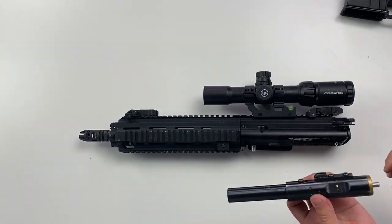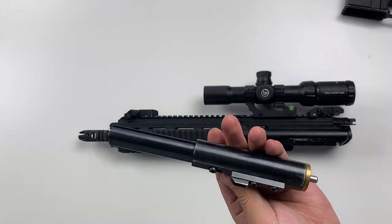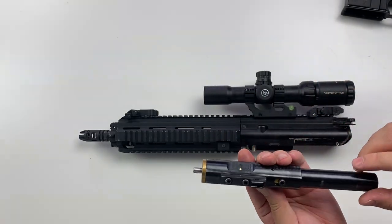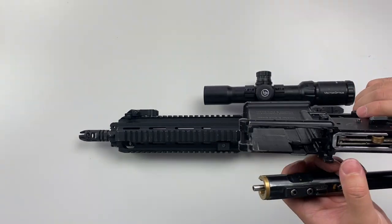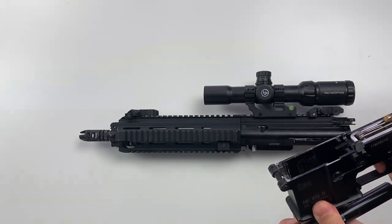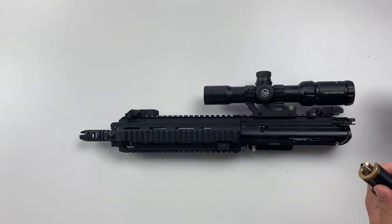The construction quality of this system is very good. They used good materials everywhere necessary. You have a blued steel bolt carrier. The reset doesn't use a hard trigger or anything — it's soft, just a bit of brass. The trigger itself is wire-cut steel. I can certainly believe this would last forever because it's steel and you don't really have any strength on it — you're just using it to press a valve. Every part is properly machined brass.